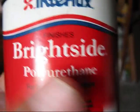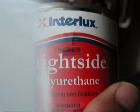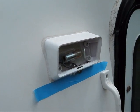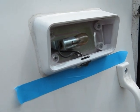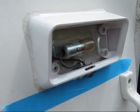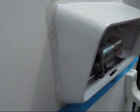It's always good to read the back of these cans — there's always a wealth of information, as long as you have a magnifying glass. We've got one coat on this now; it's probably going to need at least two. I ended up using a one-inch nylon brush, like an artist brush — relatively stiff. For preparation, light sanding with 320 grit silicon carbide — that's the black stuff, like wet or dry sandpaper used in auto body work. Make sure you tape the bottom here, and then with the brush you can pretty much use the caulking as your guideline to go around it. This is kind of a self-leveling paint, so the brush strokes aren't too hideous. After the second coat, we'll tip it out with a foam brush again — usually that gets rid of about 85% of them.